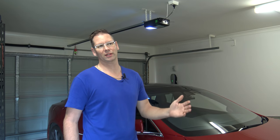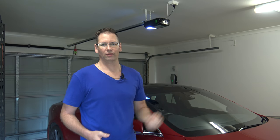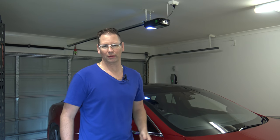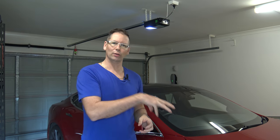After shooting that footage I thought it was a bit inconvenient having to wait for the garage door to go all the way down before arming, because I might be in a hurry. So I'll change the code to add something like a 20-second delay before it actually arms, giving me time to put the garage door down. The beauty is it's my own system on a Raspberry Pi, so I can just change the Python script to make it do exactly what I want.